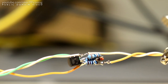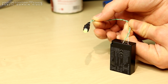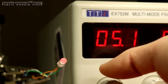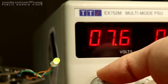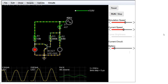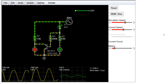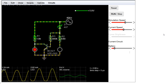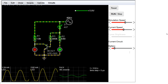And indeed, I need a gauge for a 2-cell lithium battery, which really limits my options for prefab circuits. So I'm either bound to some analog thing or I'm going to have to use a micro, and I didn't want to use a micro. So I jumped into a simulator, and this is what I came up with. It's a 6-component single zener, single transistor analog lithium battery gauge. And it presents your battery capacity from red being empty to green being full using a dual color LED. So let's have a look at how this actually works.